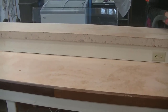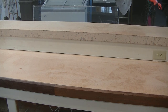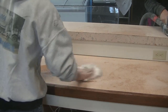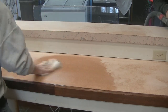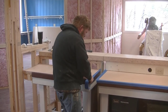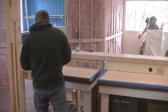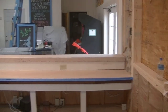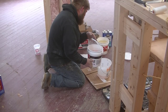After grinding, we've got to get all the dust off. I'm going to vacuum it down probably twice, then take some denatured alcohol on a white cloth rag and wipe all the dust off. Then we'll look at it and see if there are any other places we need to remove more sealer — that's what Darren's doing. I'm double-checking with water on a rag; the water evaporates fast but you can see how it looks, making sure all the sealer is off and there are no scratches left from the diamond discs.